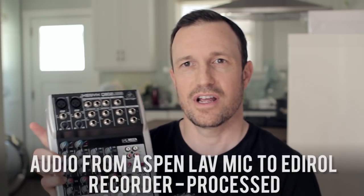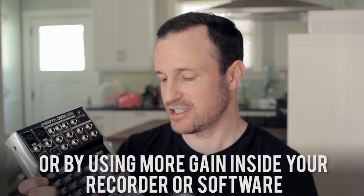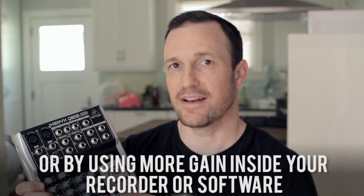Check the links in the description for all the gear I use to create this video. You should be able to go to any mixer and set it up to sound great. If your gain knob is all the way up and it's creating noise, the preamps inside the mixer might not be that good — but even on this cheap Behringer or cheap Mackie mixers, they have preamps that work really well. You can compensate a little by coming down on the gain and adjusting with the faders, but ideally you'll set it properly from the top all the way through the entire mixer to get the best levels and the cleanest sound.